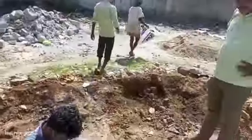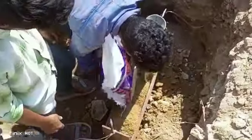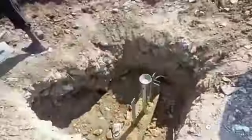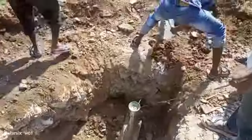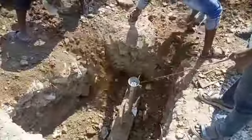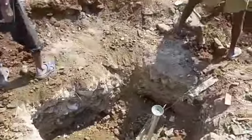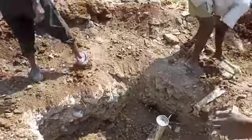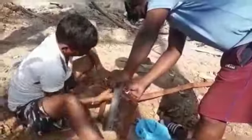Here we have seen the sand — the sand is mixed with the electrical earth powder. The mixture ratio is 1 to 3, meaning 1 part earth powder mixed with 3 parts sand, and this is kept around the earth pipe.